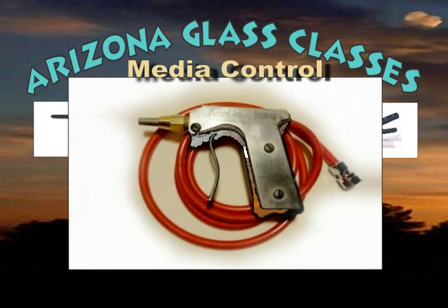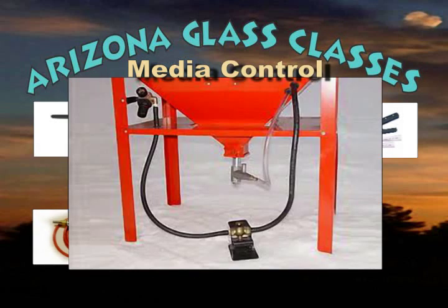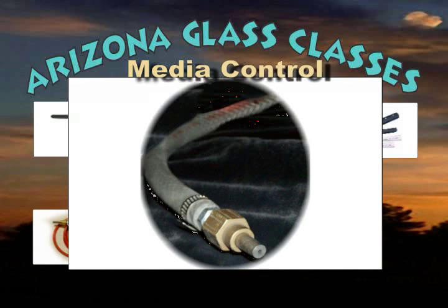The PAB gun is a trigger-activated, gun-shaped assembly specifically designed for sand carving, which is popular with a number of sand carvers. A foot pedal valve allows you to control your air and media flow at the nozzle by the touch of your foot on a pedal. They are very easy to use and the only thing left on the end of the air and media hose is the nozzle, which gives you good control over the direction of flow and does not deflect the flow when opening or closing by squeezing valves with your hand.